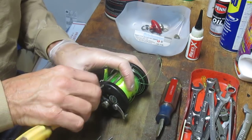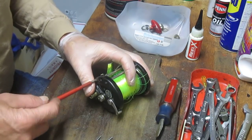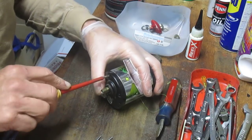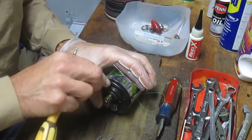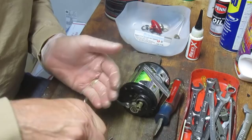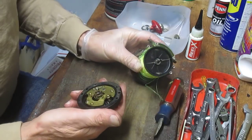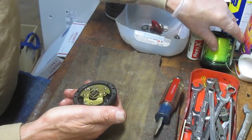I'm laying the screws out to show you — there's a different set here. The cross bars have a longer screw than the reel seat, which is common on Penn reels too. Ocean City was founded in Philadelphia before Penn and was successful. Then some folks left Ocean City and formed Penn, also in Philadelphia. So there was some crossbreeding going on and some of the designs look almost the same. I have six screws out — two small and four longer cross bar screws. Take pictures, make mental notes, and know where they came from. Schematics are available if you search for them.